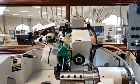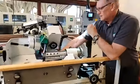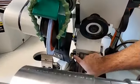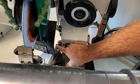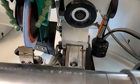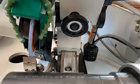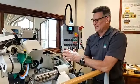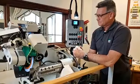Okay. The one thing that can happen, stay up here a second, Christian, is people will allow too much sediment to build up. And as they're moving this around, that sediment can get caught in here and will cause these limit switches to hit prematurely. In the past, I get a phone call and he says, hey, I used to be able to grind at 12 degrees. My machine won't get there anymore. What's going on? A lot of times you just ask them to send you a picture and it is very, very packed up around that area. And you're creating a false dead stop.